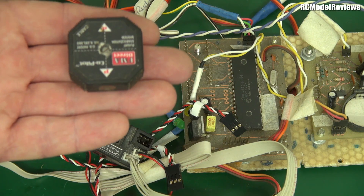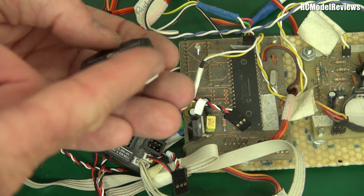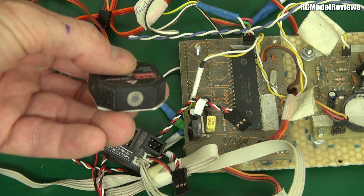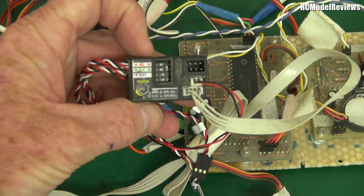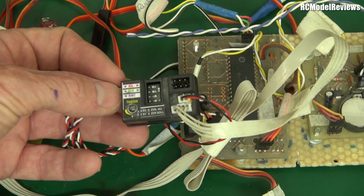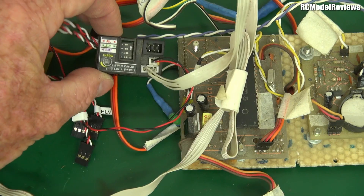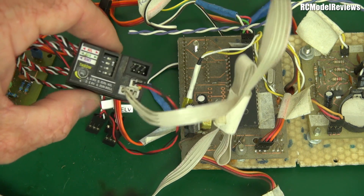When the craft is flying straight and level, all four sensors get about the same thermal reading because they're looking at the horizon — half sky, half ground. The sky is always a different temperature to the ground. If the plane banks, one sensor looks at the ground and one looks at the sky, so one will be hotter than the other and the system knows which way you've banked. Same goes for pitch — the temperature differential provides a corrective signal. It even works at night and on cloudy days; only really struggles when it's actually snowing or raining.